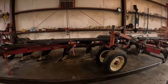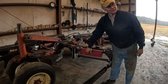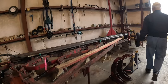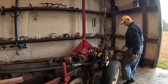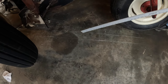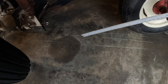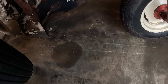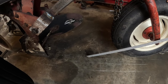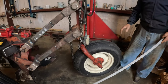Now back here — I had the toolbox up there, had to move it, so I put the toolbox right here. That's a toolbox off of a 1206. Back here, what was happening — I had to change this rear furrow wheel. Let me show you these three lines. This is your furrow wall right here; that's where it was running, up on top of the land — you saw that in part six. I got it moved over using an International 700 plow part. We worked it over to where it's about 2½ inches off the furrow wall, and that's a good place to run. That'll put it right down in the furrow and it won't be running up on the land anymore.